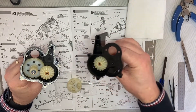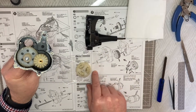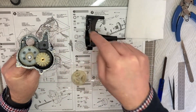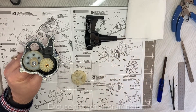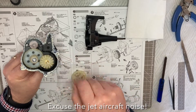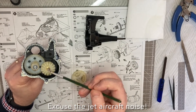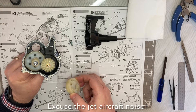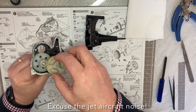Now at step nine - I've put all the grease on the large bevel gears, all the grease on the counter gear, all the grease on our differential gear and small bevel gears. You can see I've actually put a load of grease around the outside of the gearbox here to act as a seal - that's thanks to Pete Wiley, Mark Bryan, and Peter Smith. We can now put the differential gear into our part here, a little bit of grease on that shaft as well, and take our differential gear and put that into place onto our little shaft like that, and it should engage.